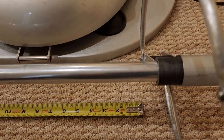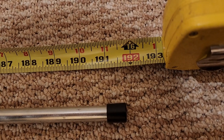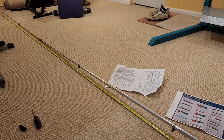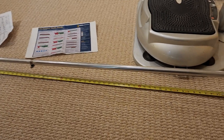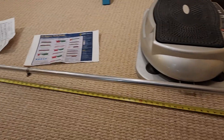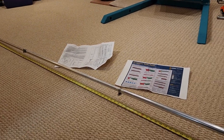The measurement is being taken from right there to the top of that bracket — about 192 inches, right around in there. I do have an antenna tuner; I like to avoid it when I can — I'd rather have everything resonant. I'll figure out my coax situation — I forgot about that. Let me get some coax at least a decent enough run to test this. I'm going to put this up on a temporary antenna mount — an old TV antenna mount from the previous owners. It's a three-bracket system, plenty sturdy enough. I'll show you what I mean. Let's get this outside and get this puppy tuned up.